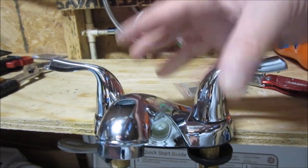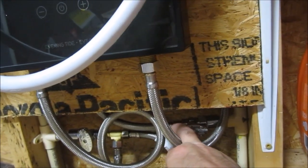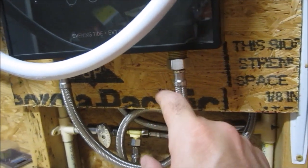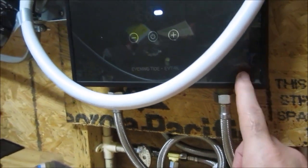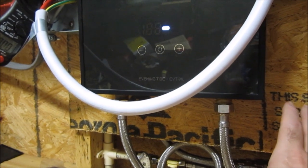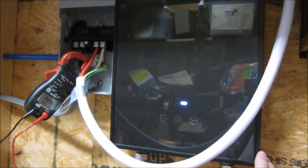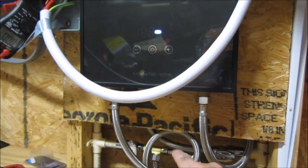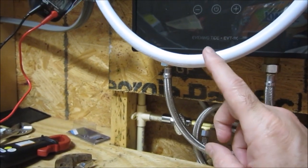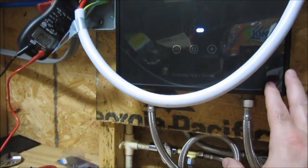Now this could be a bathroom faucet or a kitchen faucet, but if you put another 3/8 inch splitter on the hot side, on the cold supply side, you can actually put this in line between the hot and cold rails in your home underneath the kitchen sink or the bathroom sink and do a complete conversion from tank to tankless, because every device that uses hot water is on the hot rail in your house. So just putting these splitters under the kitchen sink and then connecting this with a 40 amp supply line, getting an electrician to come into your house and get permits and do all this work, will get you into the tankless world.